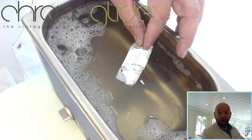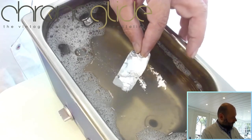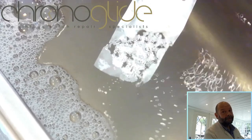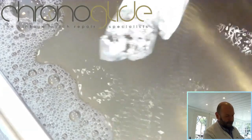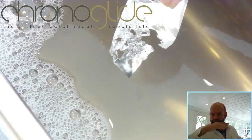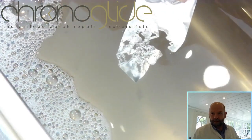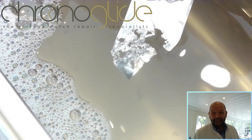I'm not going to fast-forward — this is real time. You will definitely see you don't want to put your movement parts in here. This is an excellent test if you buy a secondhand ultrasonic bath to check if the vibrating elements are still in good condition. You can see holes appearing — because of the vibrations the metal is going to fatigue. You can see it's just about completely gone.